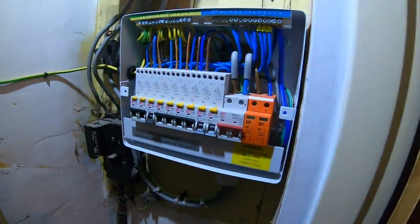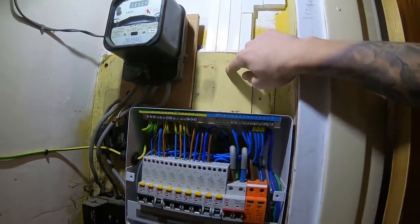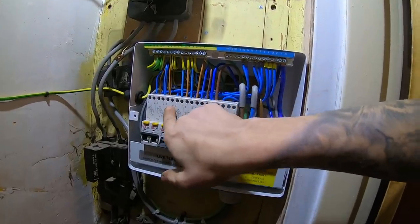Few more things to do — but until stuff is plastered properly on the ceiling, I can't quite finish off everything yet, i.e. with the fuse board as well. So I'll get the tests done that I can get done, make sure everything's safe as it should be — the RCD trip tests, ZS, all the usual malarkey — and then we'll go from there. We've done a few tests, Adam's got everything on. Trunking is all done now, siliconed up the sides, just a bit more neatness. Quite happy how it finished out — worked out really well, cutting this bit out and doing rear entry.